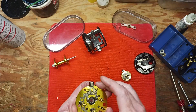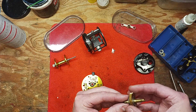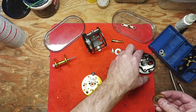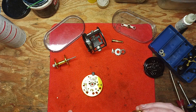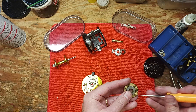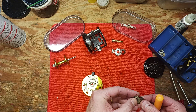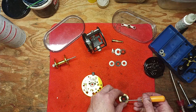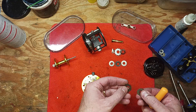We're going to put all these pieces in the tray and clean them all. Then we've got the friction clutch, shaft and clutch, and there's a spacer washer there. We're going to see what kind of shape this drag stack is in — it's an old leather stack but so far it doesn't look too bad, we've seen worse. Just needs some cleaning.